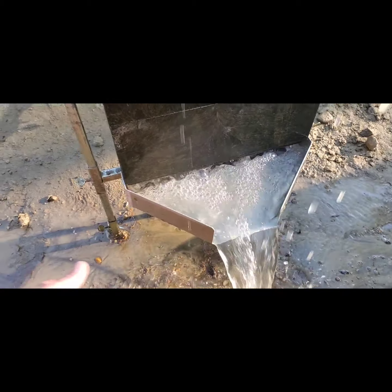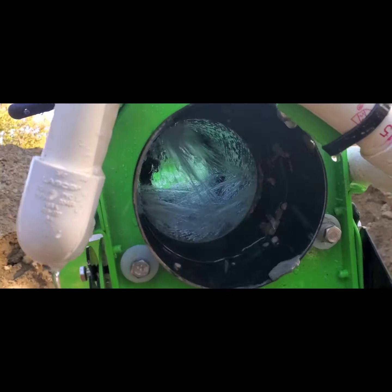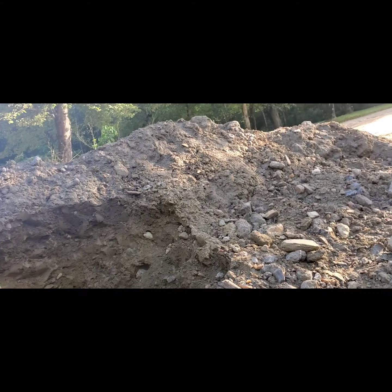Got the grizzly bars. Now one thing that I did, the water's real cold, so I ain't been using this much. I put it on here this morning just to mash up some clay, but man, this water's done got cold. So what I've been doing to help really break the clay up, and it does a wonderful job. See them spray the bars? There's three spray bars up in there. Now, watch it. I turn it off. When I get all the material shoved into the barrel, reach up here and turn this off. Look how much more powerful that got. Man, it got real powerful.